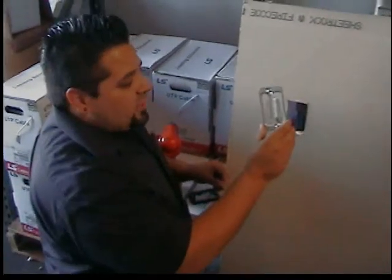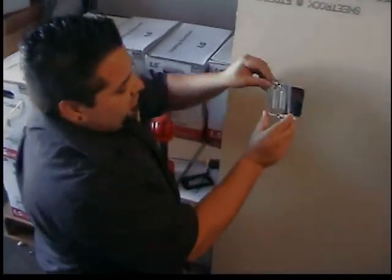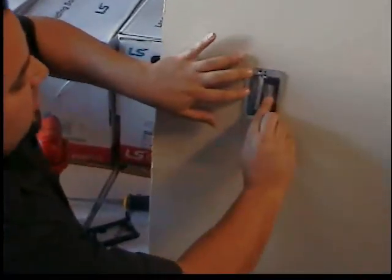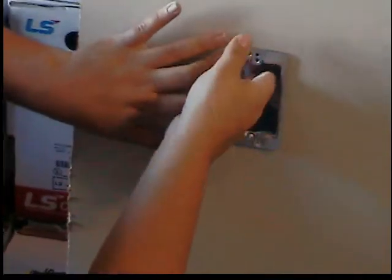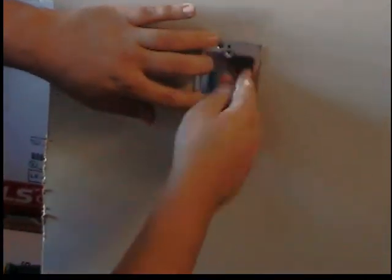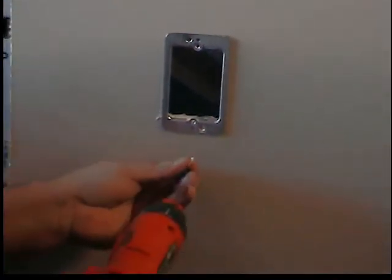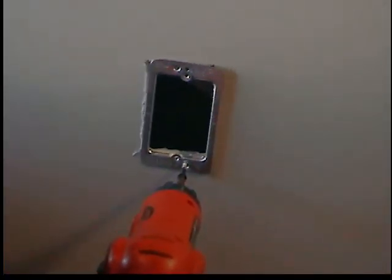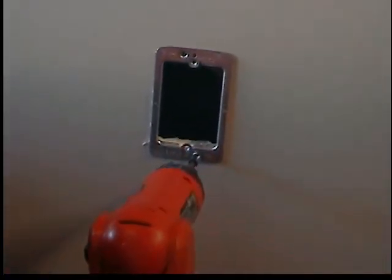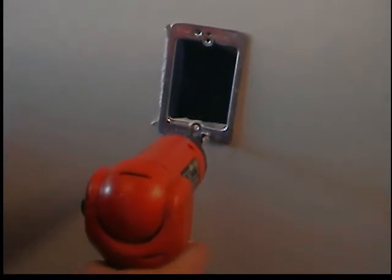This is Erico's MPLS — their steel mud ring. Basically you put it in place, curl the tabs into the sheetrock for the top and the bottom, and then it includes a couple of screws and an opening where the drywall screw should go. I'm not going to do the top, but you can see what it looks like on the back.